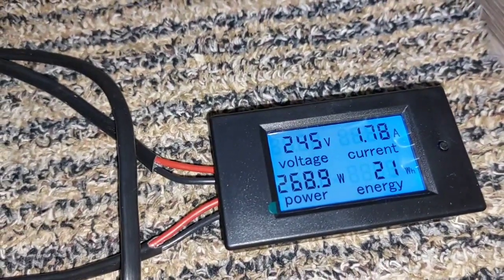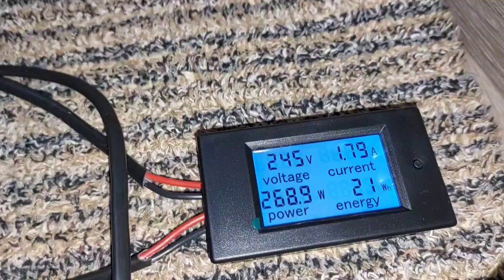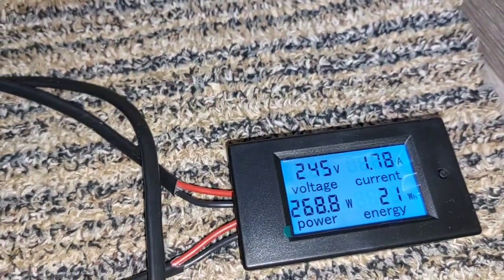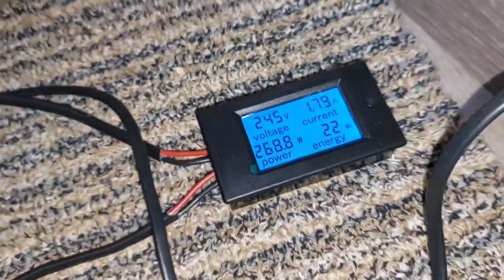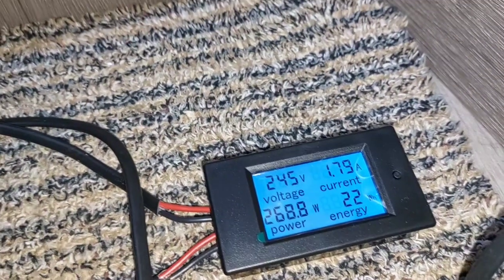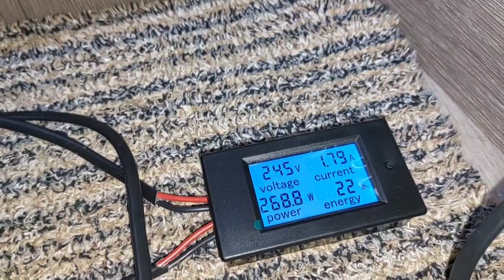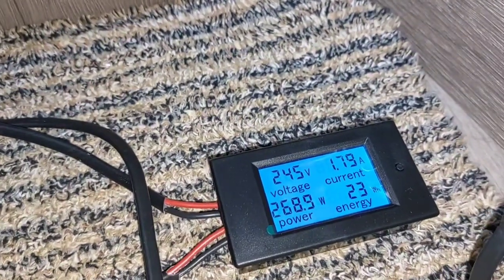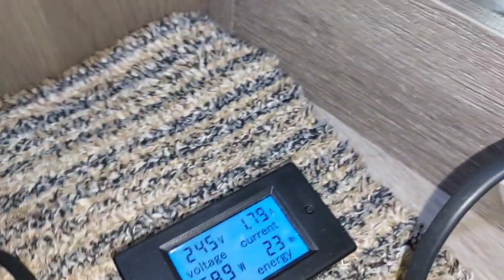The majority of time I'm on hook-up sites on electric hookup, usually with a 16 amp trip switch or MCB on the supply side, and then on our box we've got what looks like a 30 amp MCB. These are pretty easy to wire up — they need a 240 volt supply and also a feed from the CT winding that detects how much power has been used.